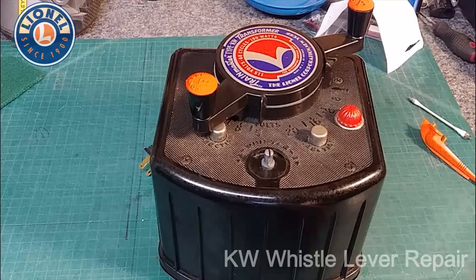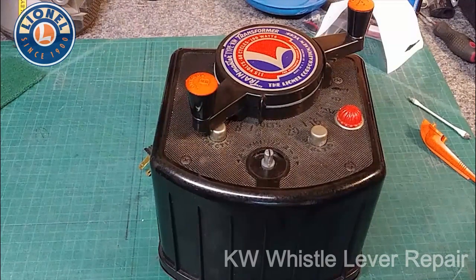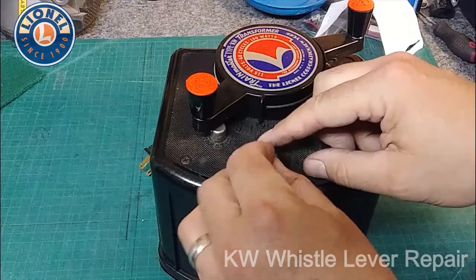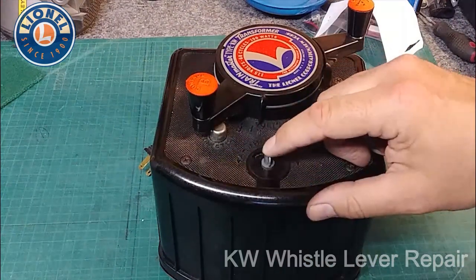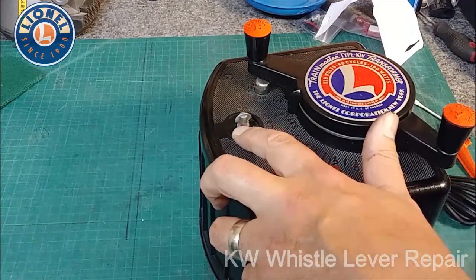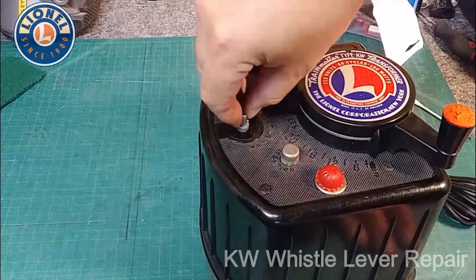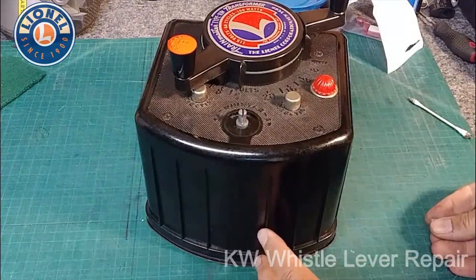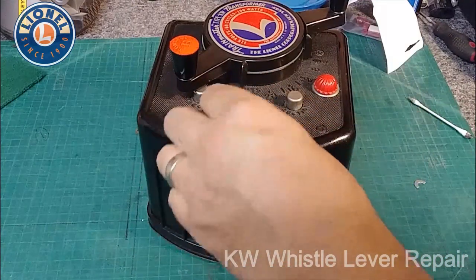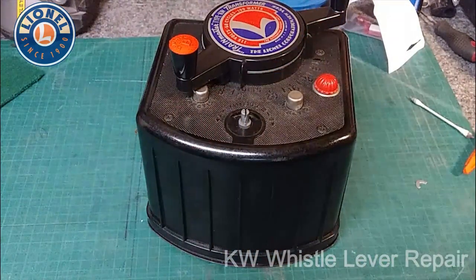So what I'm going to try to do is, I got myself a flat washer, and I've already cut it in half, like so, and I want to drop it down into this notch because it fits perfectly, just like that, and I want to try to file the wings down a little bit so they're more in line with where the originals were, so that it will sit in here and create a much stronger grip into the handle. And then I won't have the handle slipping when I try to, see, it just pops right out. So hopefully with this washer dropped in there, filed down a little bit, it will sit into the handle better and hold it all.